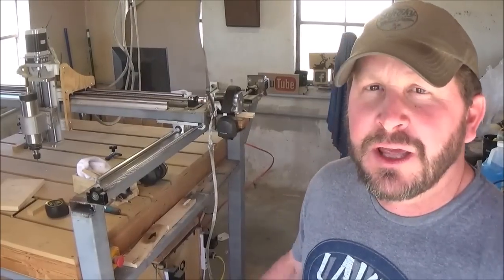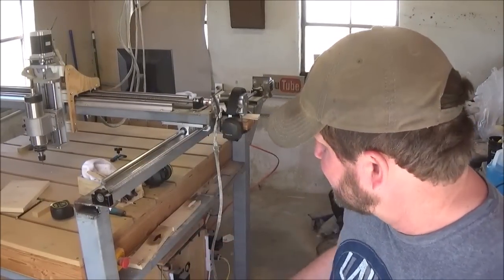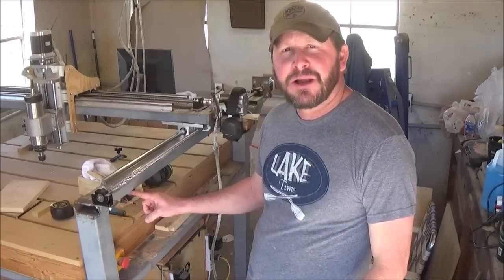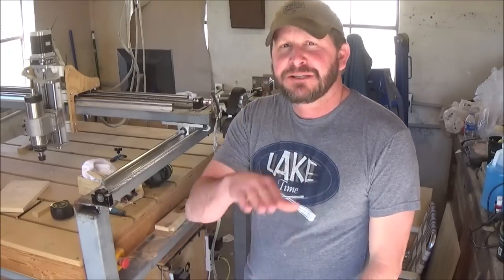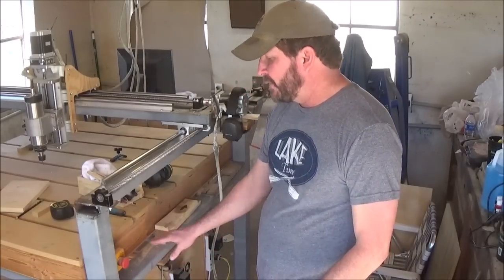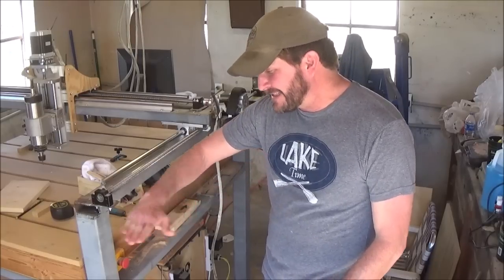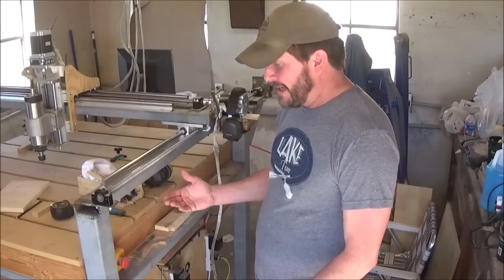Right over here, we're looking at the top rail and that bottom rail that's 36 3/8. From the top of this, I went exactly 12 inches to the bottom of the top one. I know that's confusing lingo, and that may be where I'm screwing people up. So from the top of your bottom rail, go up 12 inches, and that will be the bottom of your top rail. Your top rail I've got sitting right on top of my corner post. That should make it easy enough.